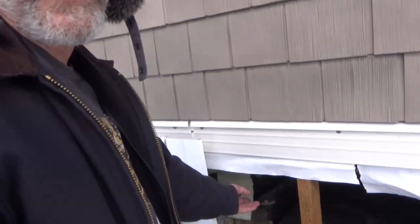It's down here, where all the other P-trap things are up above, so they're going to be protected by the heat in your house. But that froze, so I was taking a shower, and the water just started filling up the bottom. Eventually the hot water melted the ice, but even the drain for that will get frozen up pretty good under here.